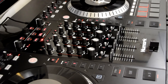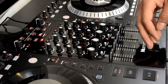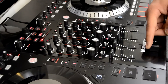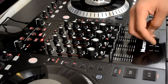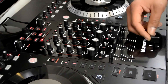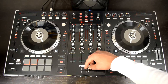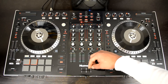First up, we're going to talk about the mixing console. At the bottom, we have the crossfader — it's a really nice, smooth, sturdy crossfader, the CP Pro, familiar to those who've used professional Numark mixers like the SMX Pro and the DXM Pro. It's very sturdy, really fluid, and has basically no resistance whatsoever. It's really good for scratching, with a really low cutting distance of about 1 to 1.5 millimeters, so I didn't have any problems pulling off scratches with this fader.